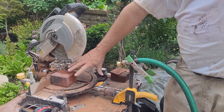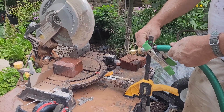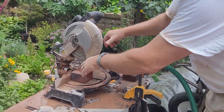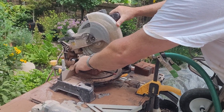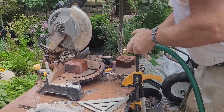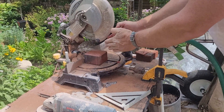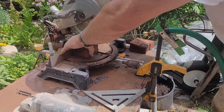Whenever I'm ready to go, I open up the nozzle and it sprays water right here. I moved my saw left and right to get right in the stream. I'm going to line up my saw — I kind of already lost my pencil line, but it's about right in there. I'm going to turn on the hose and crack open that ball valve. The jet spray is lined up on each side of the blade so it gets water on both sides.